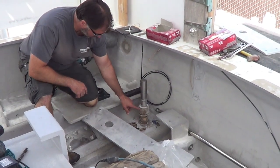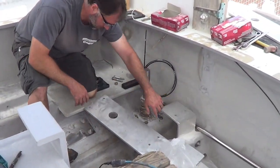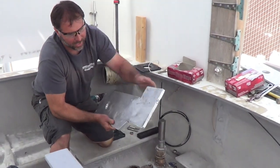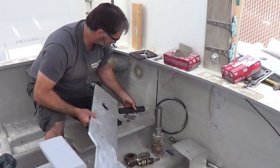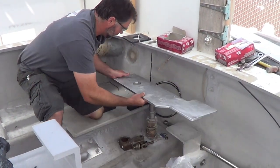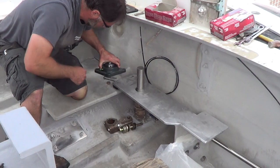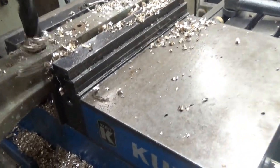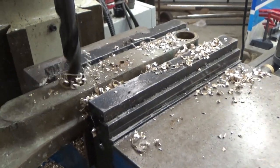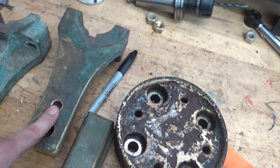We've got the packing for the rudder shaft in, and we've got the bracket made here for the stringer to mount the steering plate. Frank's welded up a nice plate — he had to add a little bit on here. Cut a little bit out because the generator's going to be here. So we've got a little starboard spacer, about a one-inch spacer, it's going to make that level across here, and this is going to go on like so. Next up we're going to slide this down over and drill for the self-aligning bearing. We're here on the mill drilling the tiller arm for the timeout. So we're just modifying the tillers here — cutting them to length — and we drilled a half-inch hole in one and a five-eighths hole in the other.